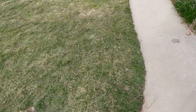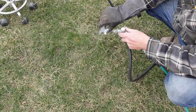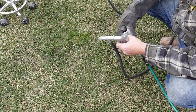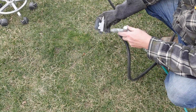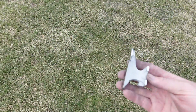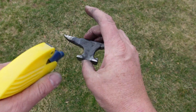Once we're happy with it and it's sanded to a pretty fine finish — or even polished to some degree — we can bring it over to get sandblasted. I'm using a portable sandblaster; I have a cabinet but was having some issues with it, so I brought this out to the grass. Sandblasting gives us a nice uniform finish to polish from. Then I'll go ahead and put it in an acid bath.